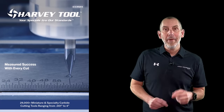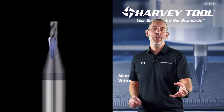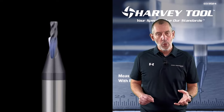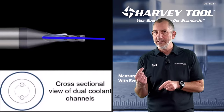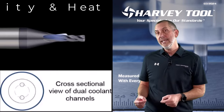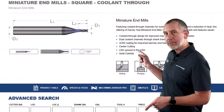First tool up on the docket — it is time for Harvey Tool to have a miniature end mill with coolant through, and that's what we did in this catalog. We added coolant through in one of our miniature series end mills. The coolant comes out the transition area, getting your coolant right down to the tip of your tool. It helps with chip evacuation and helps reduce heat. Lubricity and heat are two of the killers on a miniature tool.